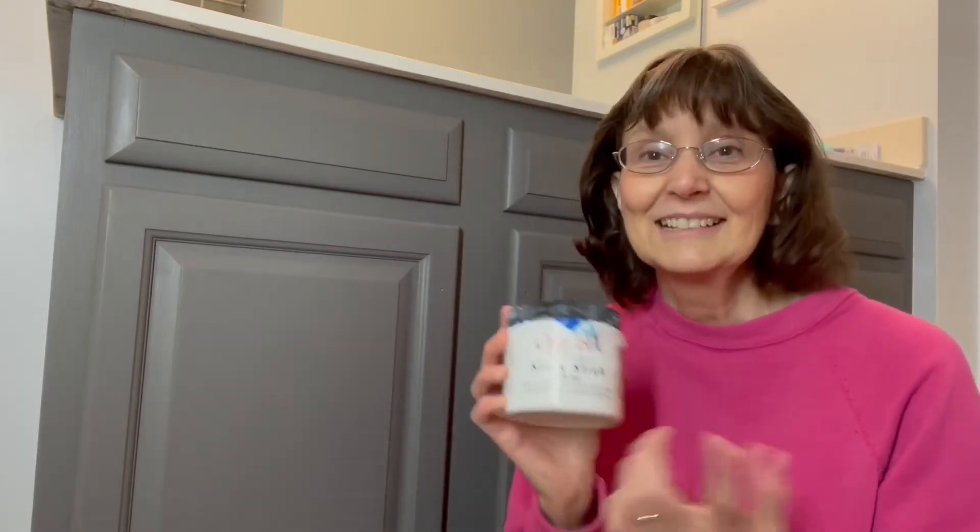Here's what I did. If you want to find out how I got to this point of painting, go back and watch my powder room makeover — I'll link it in the description. Basically, I cleaned, then primed with Boss. We have new Boss in Gray, which is great under dark colors, so that's what I used. Because I had a slick surface on the side, I also used Slick Stick.